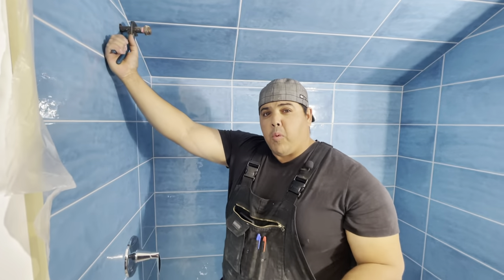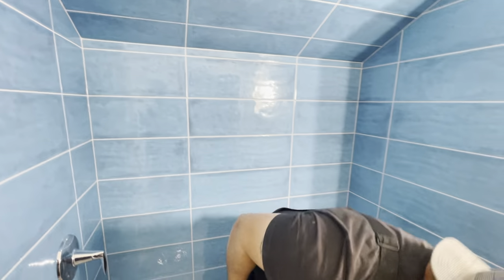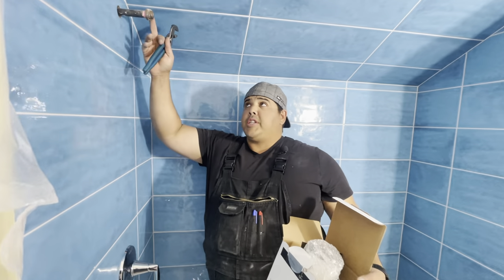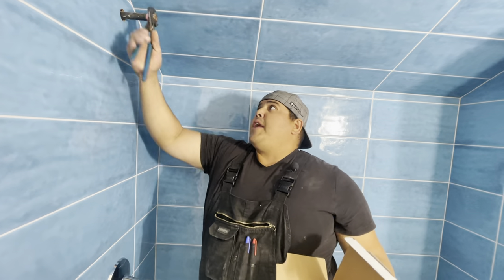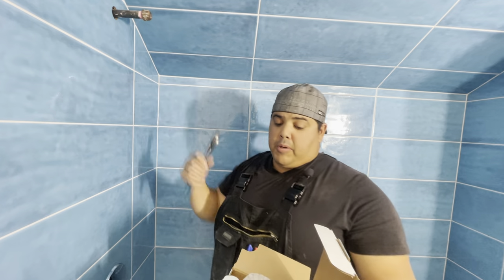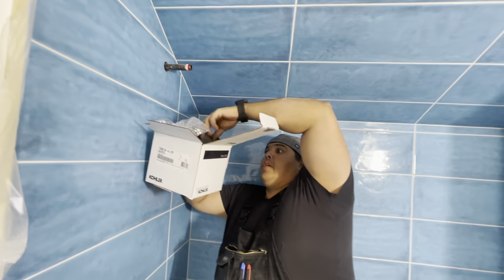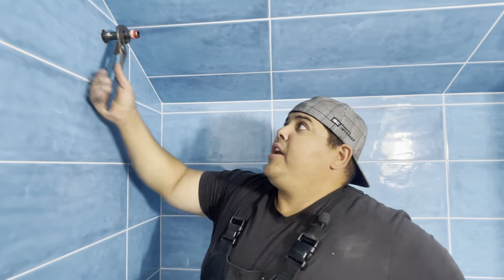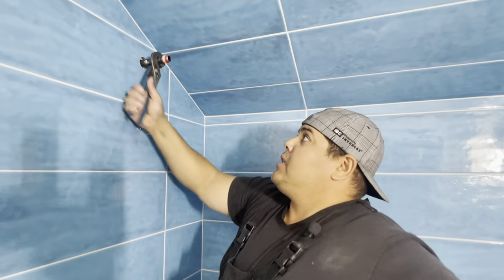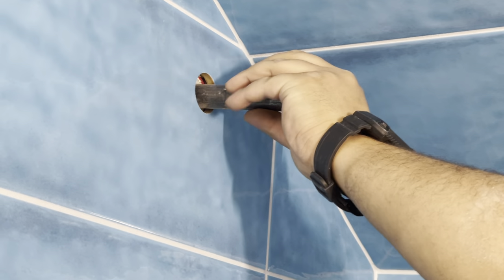When I'm doing this for, say, in a basement where this might still have water in it — this actually still might have water in it — we'll just use this box. The reason why you want to just take the cap off is because the water that comes out of here is somewhat rusty if you're using iron pipe as a cap like we are. But I know there's going to be no water in here. Just as a safety precaution, we're just going to use this box — I'd use a bucket if I knew there was going to be lots of water, but in this case there might just be a drip. And that's the reason why you're not allowed to use black iron for potable — because it rusts. When I'm taking these off, I just push a little pressure up against the wall so that this thing doesn't fall and break or crack your tiles.